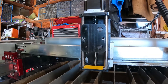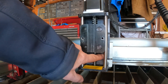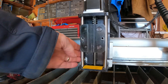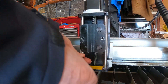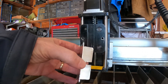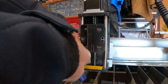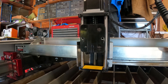Looking at the front end, we've got two screws — one here and one here — that basically hold the torch height controller assembly to the main assembly. We're going to use these two screws to attach the inside panels. I'm going to loosen one of these, and here's what the side guard is going to look like. A DXF file will be in the description below. We just slide that in and tighten the assembly back up, then do the other side.